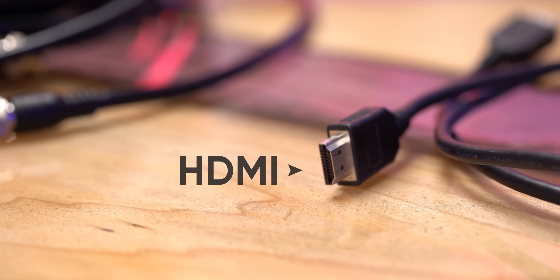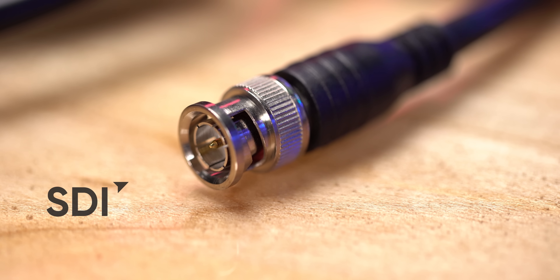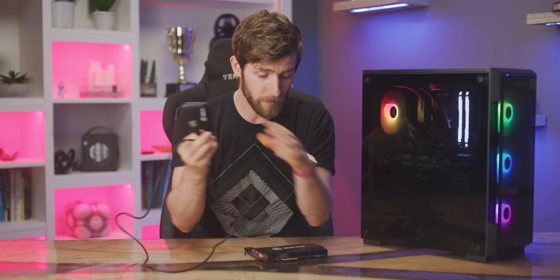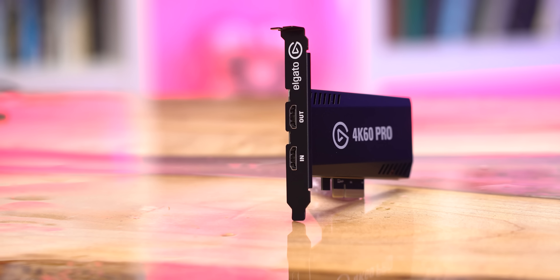For consumer devices, it's typical to see an HDMI input, like what you'd get out of your game console, but in the professional world, SDI is preferred for its longer maximum cable lengths, support for timecode, and locking connector. Now a typical capture card looks either like a box that plugs into the USB port on your PC, or like a box that plugs directly into the PCI Express slot on your motherboard.